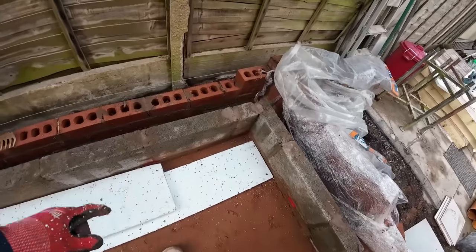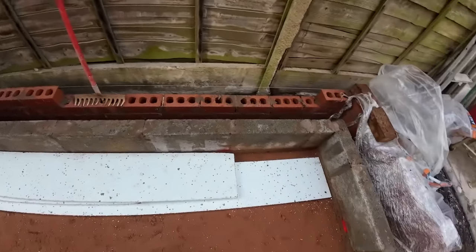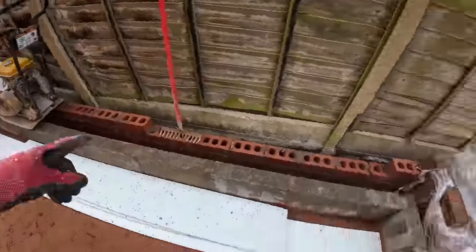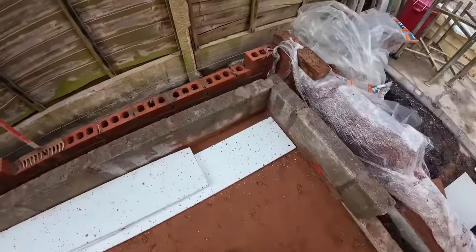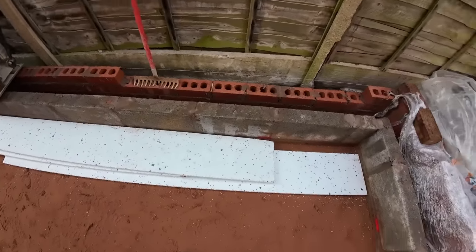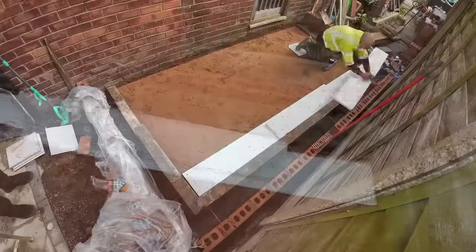Rip these down up to damp. Now we're just going to fit them around the perimeter like we always do. I'm going to take them out again and we're going to do our brickwork repairs, and then we're going to put them back in again, and then we're going to cut our Visqueen. So we'll put you on the time lapse for this.